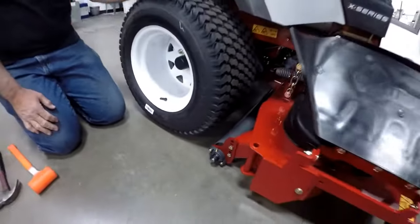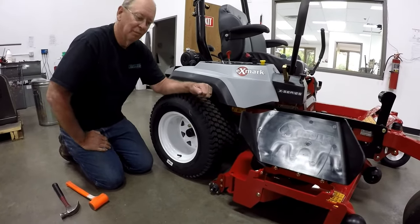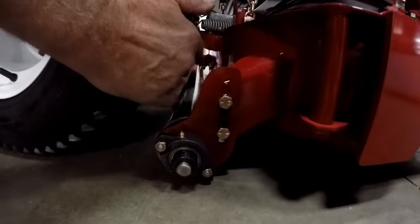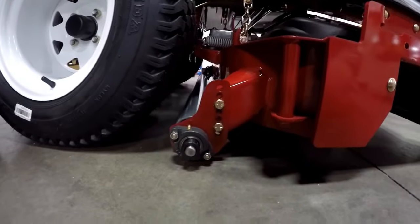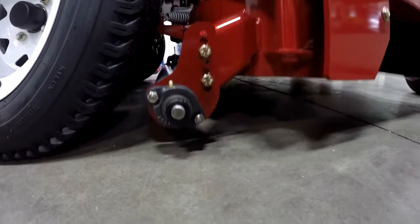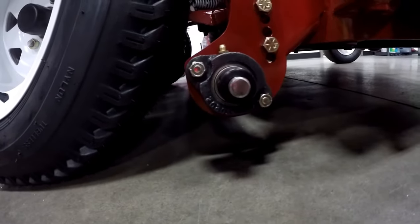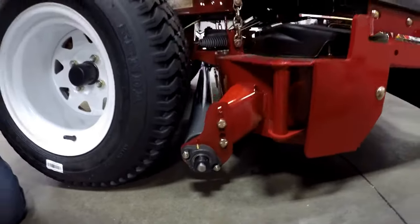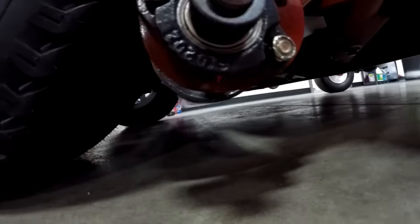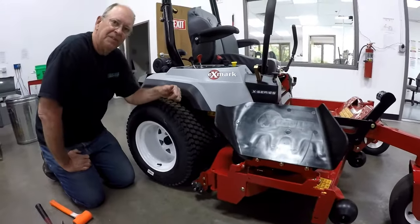Do the same exact process on the other side. That's it — this kit is installed and we didn't have to do anything to the machine. It's the full length, going almost as wide as the tires. I'm so happy that the manufacturers gave us a little more space so we can have these big rollers again. Even when the deck is raised into transport mode for trailering, the roller will not come in contact with the tires — you still have room to trailer your machine. If you're mowing at three inches or even two and a half inches, you've still got enough room. Any questions, give us a call. Thanks for watching — hope it helps!